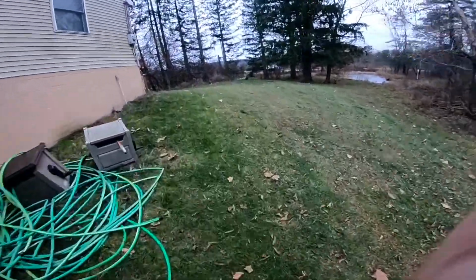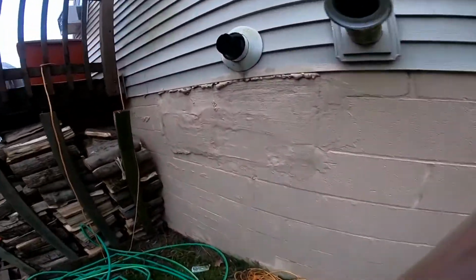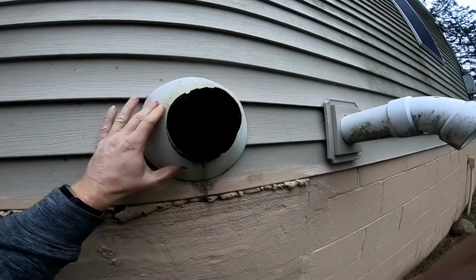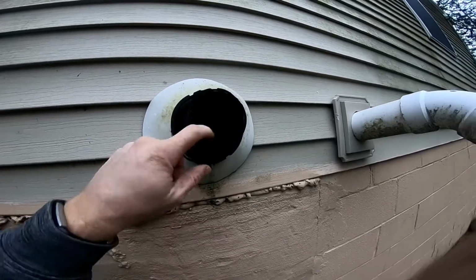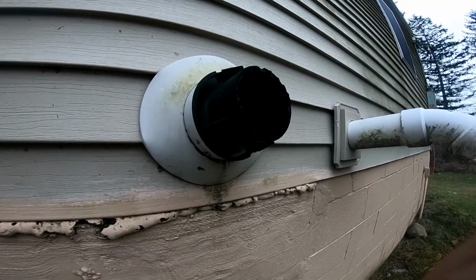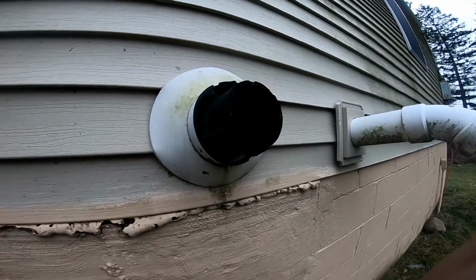Okay, so what was going on? I noticed that this was blowing out extremely hot and the screen actually came off, and the tankless water heater was making a lot of noise inside, and that could all be caused from scale buildup. So that's a big reason why we want to go ahead and get this fixed, and we're going to do a flush on the system. So I just wanted to point that out.